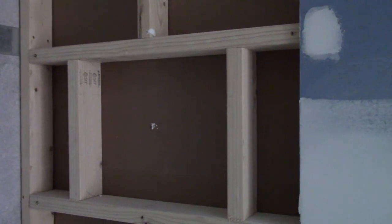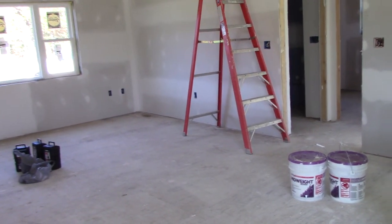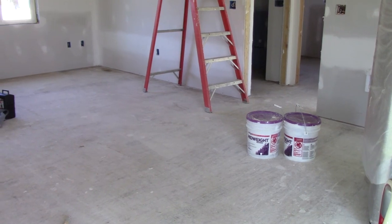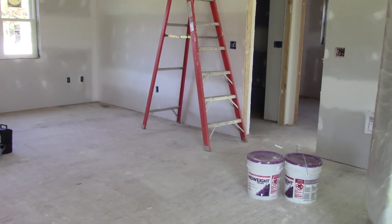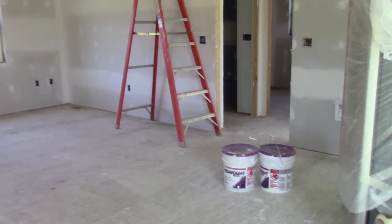This one is actually too wide. I bought a 16-wide by 14-high shower box. So I framed out a 16 by 14 opening because that's what it said on the box. But the box is not actually 16 by 14 — it is smaller than that. For whatever reason, the 12-inch ones are 12 inches, but the 16-inch ones are sized a little bit smaller so you can fit them in between studs. That's fine, but if you're just trying to frame it, they didn't say rough opening dimension versus actual dimension — they just gave the actual dimension and it's not actually that wide. So I'm going to go get those out of the car, finish installing both, work on some drywall, and keep going.